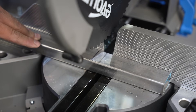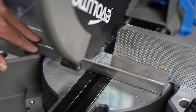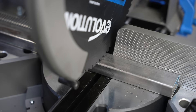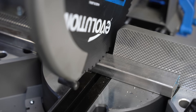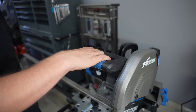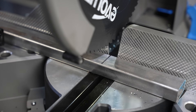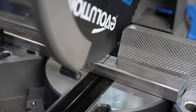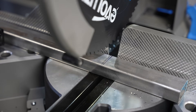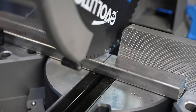Take a look at my favorite new feature on here, which is this shadow line that shows exactly where your blade's going to cut beforehand. Without this you'd have to pull the blade clear down to the stock, and sometimes it can be difficult to see exactly where your kerf is going to be. To use it, all you do is pull the handle slightly and it'll hit a stop before the motor engages. The light turns on revealing the shadow line, and then you can slide to line up your markup exactly without bringing the blade all the way down. The nice thing about a shadow line is that it doesn't have to be calibrated like a laser might, because it's shining directly past the blade so it's always going to be accurate.